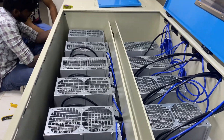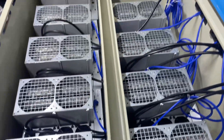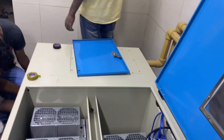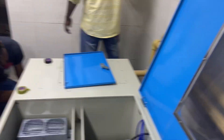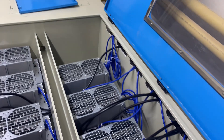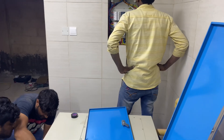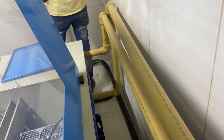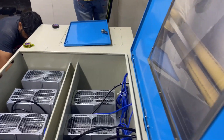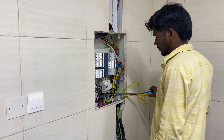Right now we're putting the miners inside the immersion tank. As you can see, we're connecting all the wiring — including ethernet cables and power cables. The tank itself has its own power distribution: it's three-phase converted into single phase, because the miners run on single-phase 240V. The PDU as well as the ethernet wiring all run through the back of the tank. The guys are sorting the main cable connection from the main power box.